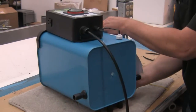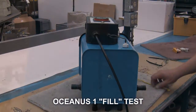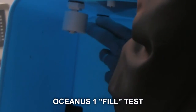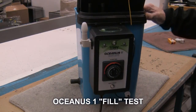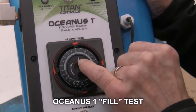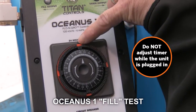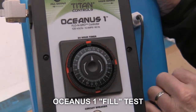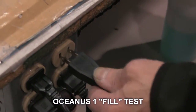Place the Oceanus One on its backside with the 24-hour timer facing up. Position both float switches in the down position towards the bottom. Take the nightlight or voltmeter and put it in the fill side, left side, of the Oceanus One. Then turn the 24-hour clock dial to function in the fill cycle. The white arrow on the timer will be pointing at the orange section of the dial. Plug the Oceanus One into a 120-volt outlet and the nightlight should be lit.